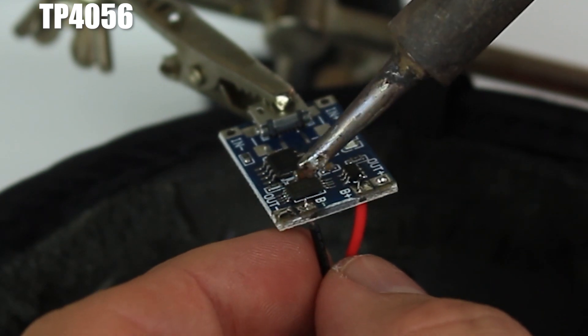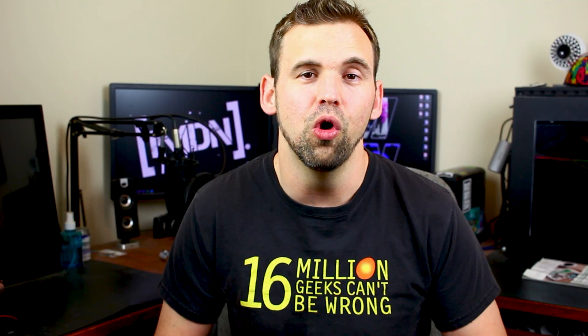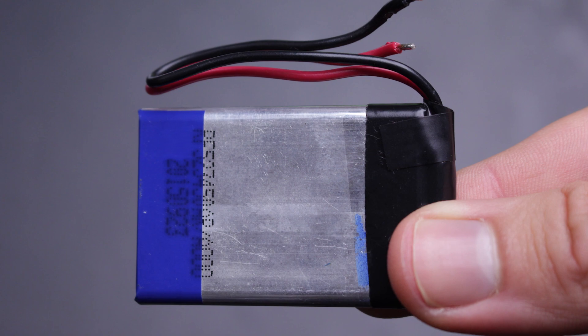A word of caution for those of you using lithium-ion batteries: you want to use them with a battery management system that includes overcharge and over-discharge protection circuitry. This means the batteries will not charge more than they need to be and they won't over-discharge — both of which can result in fire if you're not careful. You might also remember when hoverboards and quadcopters were exploding into flames. The other side of the coin is lithium polymer batteries, which are the most energy dense, inexpensive, and dangerous batteries you can use. These are commonly found in cell phones — do you remember the Galaxy Note 7? Because Samsung hopes you don't.